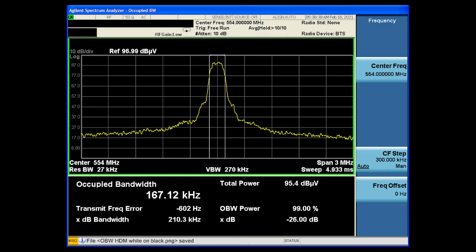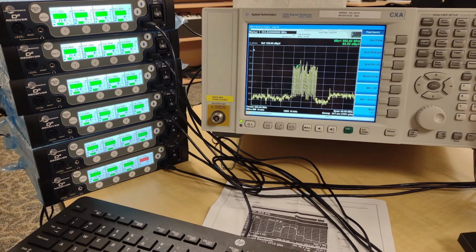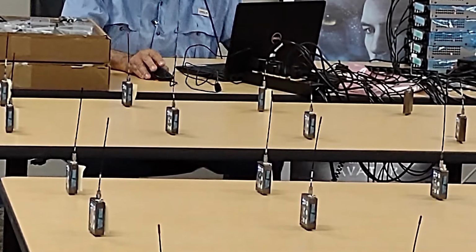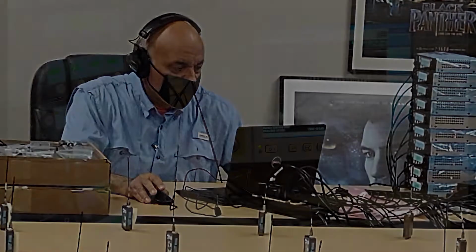Standard ETSI-compliant RF carriers take up about 200 kHz of occupied bandwidth. HDM, on the other hand, takes up half of that, or 100 kHz, and allows for much tighter channel spacing. And when selecting this mode on the transmitter, the RF power is set at 2 milliwatts, resulting in extremely low intermod products, even when multiple units are physically close together. The transmitter-to-transmitter IM products are below the noise floor, and thus do not have to be considered when coordinating frequencies. Because of this, carriers can not only be closely spaced, but also evenly spaced.